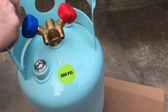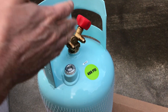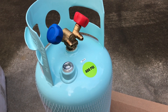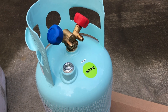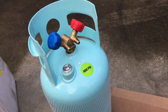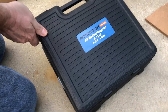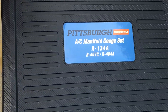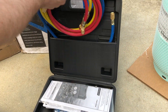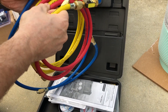We're going to have to pull all of this nitrogen out, but it's too heavily charged to begin with. We're going to have to bleed that off until we get to the point where the vacuum pump can handle it. What I'm going to do is use just a regular gauge set — my existing Harbor Freight Pittsburgh R134 gauge set. Nothing special; you just need a gauge set. We're interested in hooking this up to a vacuum pump so we can pull that nitrogen out.